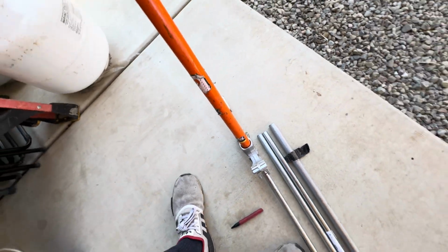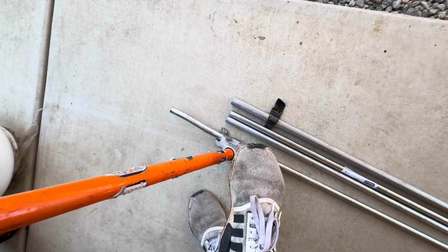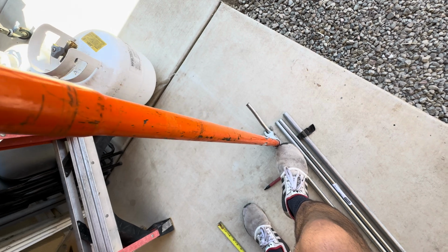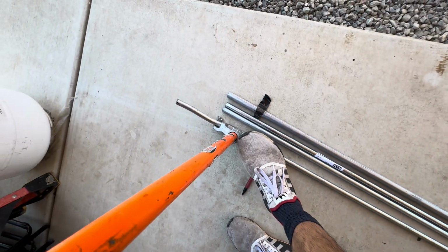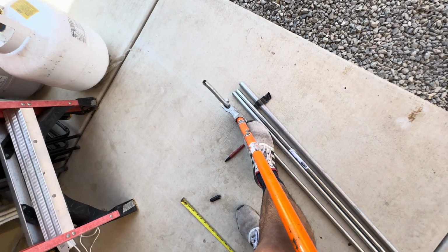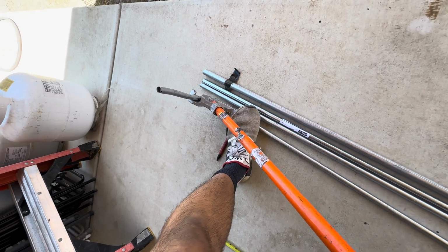So the way you want to do this is firmly put your foot on the back end of the bender. You want to pull back straight up, also using some force on your arm and leg. You don't want it to raise from the floor, because then you're going to lock a dog leg. I should explain what that means later on. So you want to keep pushing back, put pressure down. Got to switch legs right here, skinny legs, chicken legs. So you keep pushing back.